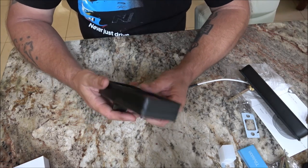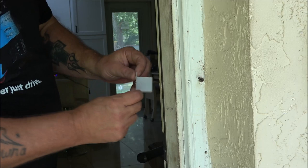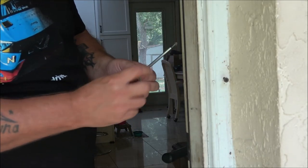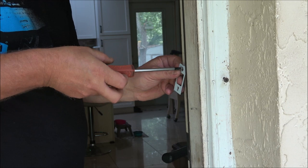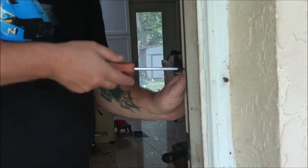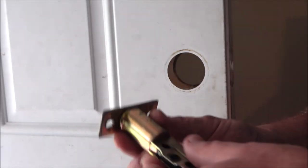Here's the other part — this is where you install your batteries, and again this can be used standalone without the app, but we're going to use the app. First I need to uninstall my old deadbolt. Now we're going to put our strike plate in with our strike box — that just pushes straight in. Then we put our strike plate on with the provided screws.